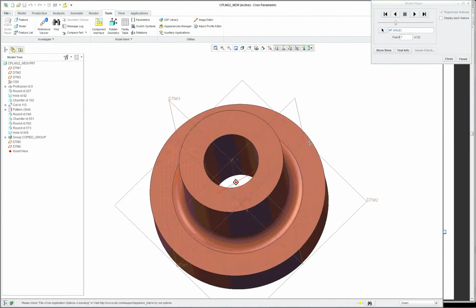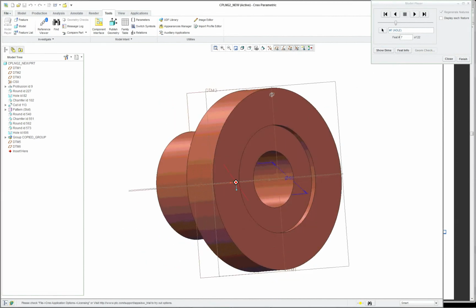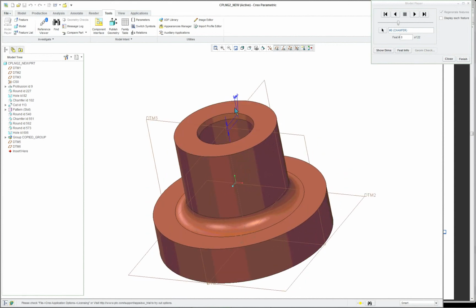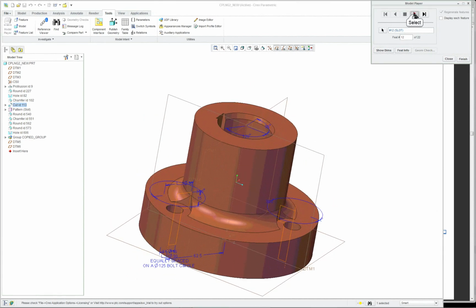So then we have the hole down the middle. And see the dimensions for the hole. Got a chamfer put in. Probably could have added that with the hole. And we have the key seat. And we have the patterned hole. And in this case, it looks like it's, again, a revolved cut. Done with a slot command, which is a revolved cut, basically.